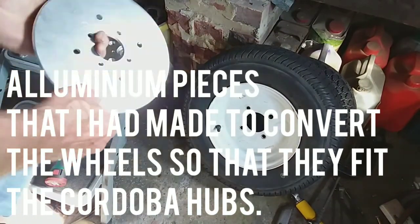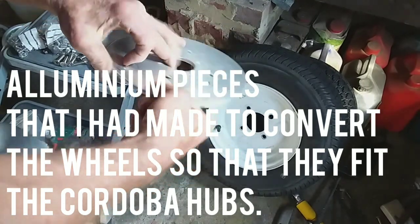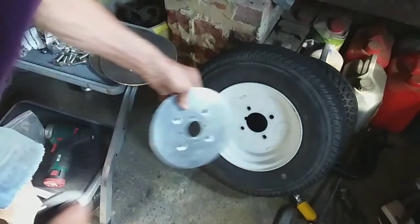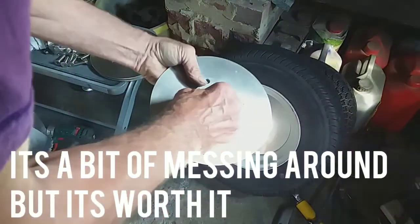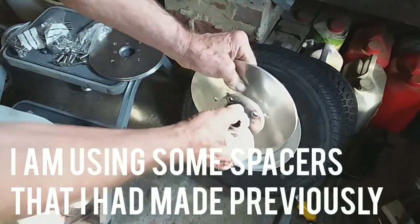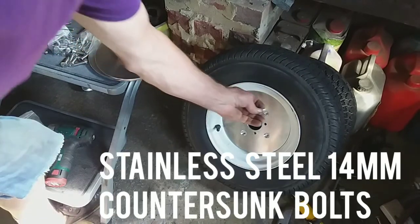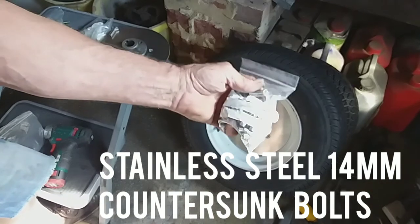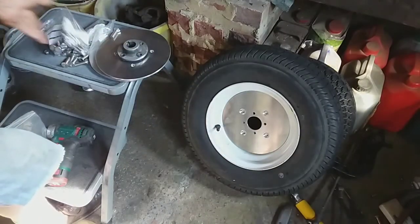Because I'm fitting these trailer wheels on, I've had to have some bits laser-cut — about a tenner each — and I've drilled them out so the hubs are going to go in them. There's one on each side, and I've got to pack them out with spacers to get the wheel at the right distance. I've used stainless 14mm bolts done flush in case I want to put hubcaps — saucepan lids — on. I've also replaced the bits that hold the split rims together with stainless because I can't handle all this rust.